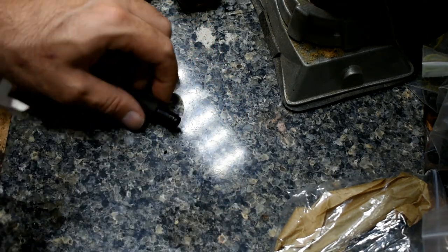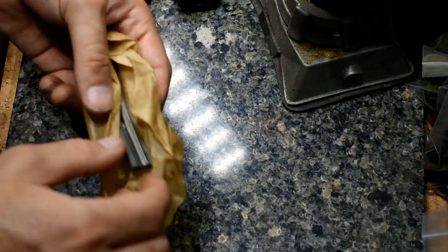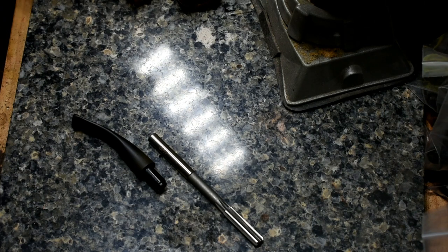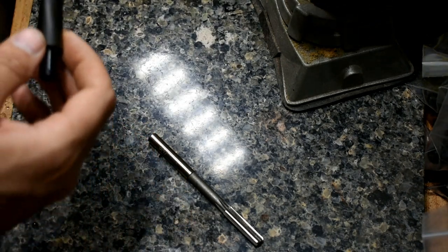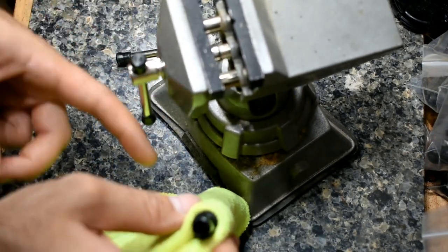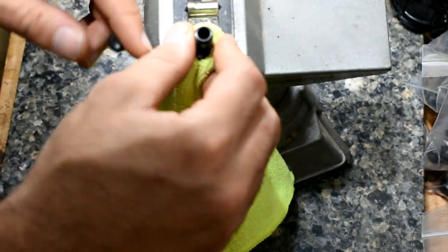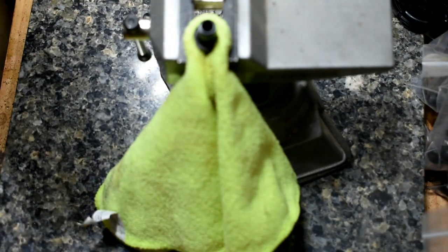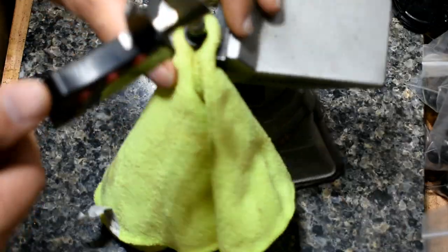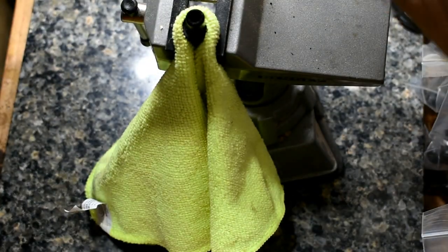This stem does have enough meat, and I just received my eight millimeter reamers in the mail about five minutes ago. I'm going to, without cutting anything, show you guys the process I would use to do this. I'll take my little baby vise here, wrap the stem in a microfiber cloth so I'm not digging into it, get a little bit of grip, then go to my drill index and start measuring. The existing hole is 6.03 millimeters, so that is our starting point.